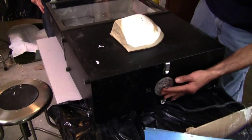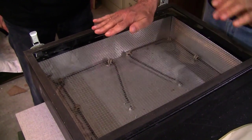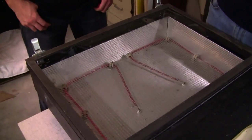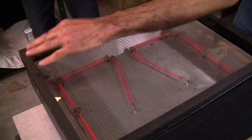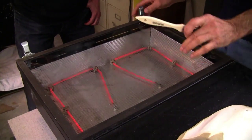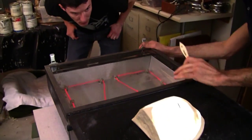So here we are heating the plastic. You'll see the heating elements start to glow a warm color. We're trying the thinner plastic first because I'm a little skeptical that the thick plastic Rob bought is going to work in my machine — it's not a toy machine but it's not industrial heavy-duty either, and I don't know if it's up to the challenge. This is the thinner sheet — 0.022 thickness. The ones I got are actually 0.110, so it's one-tenth of an inch thick. This is kind of experimental; I haven't done this kind of sheeting and I'm not sure how soft it should get — just using judgment, intuition, and guessing.